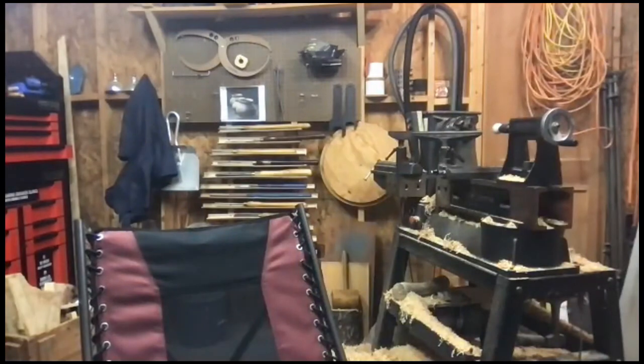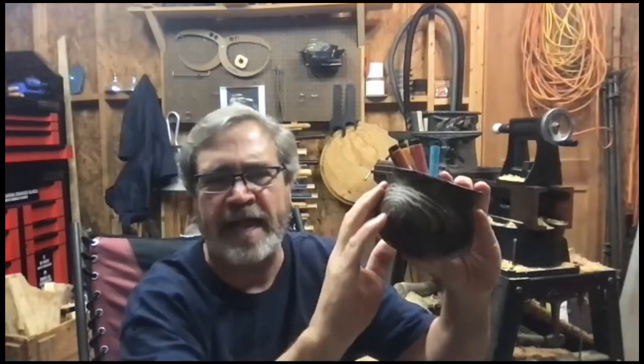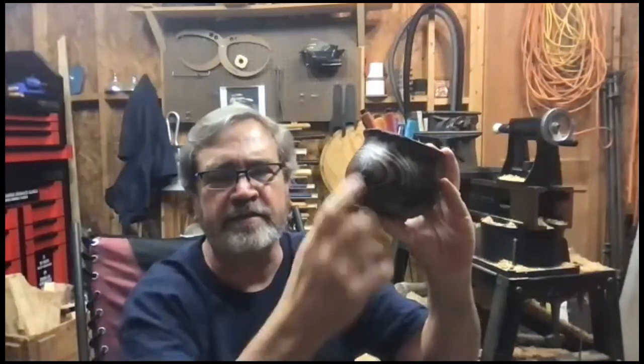Lars, have you ever tried liming wax or any of those other things to highlight the grain? I haven't used liming wax, but I think I should. I showed this one in one of the show and tells. Instead of hitting the high points, I painted the whole thing with copper metallic paint, and then I just sanded it back, and then this has an oil finish, and so this is doing what the liming wax would. It's more of a paint. It's just these little paint bottles I got from Amazon, and it's like 8 different colors of metallic paint, and I chose the copper one for that.